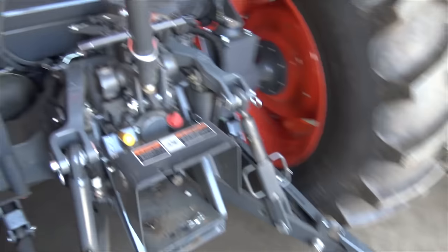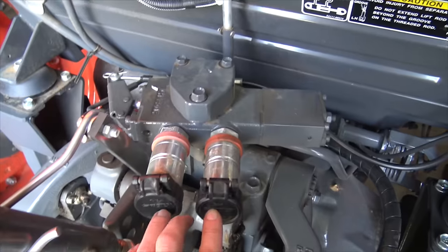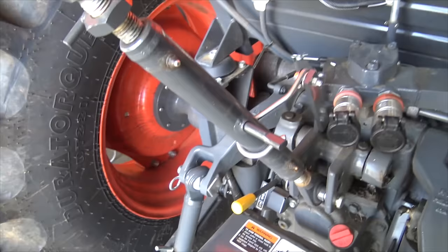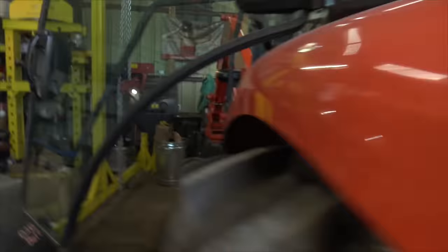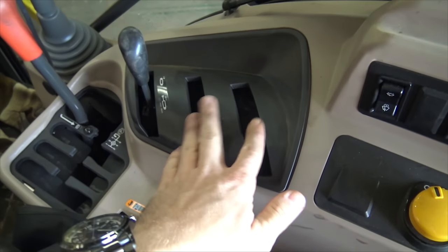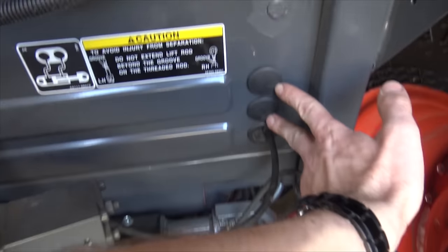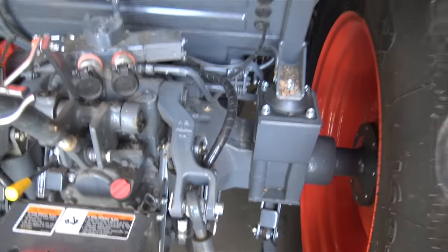What's up, I'm Chucky2009 — behind me is my M7060 Kubota. Today we're going to be taking this thing from what I believe is its factory configuration with one set of remote control valves to three sets, so I can have two implements operating and also get a three-point hydraulic top link. I've never done anything like this before, but I understand basically what we need to do: remove this plastic panel, and there are two extra slots already here, plus two plugs on the back, where we'll run two more cables and stack our valves on top.